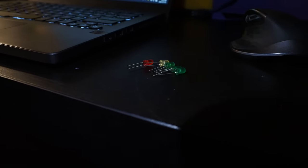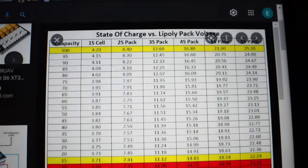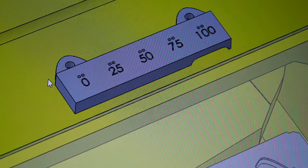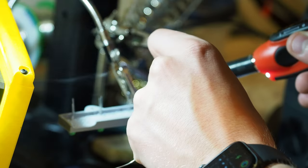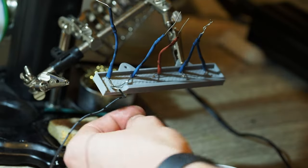Since I'm not going to have the laptop in the lake, I needed a way to show myself how much juice I had left. For this, I decided to go with five LEDs for the display, which gives me about a 20% resolution for the battery percentage, which I think is probably good enough for this application. So I designed a little LED case that would mount all of the LEDs, and it had a little numerical display to show how much battery was left. Once I printed out the case, I wired everything up, hot glued all the LEDs in, and mounted it onto the boat.